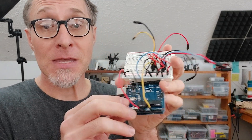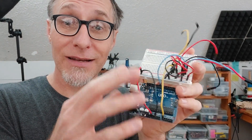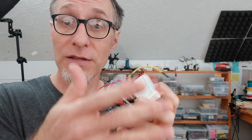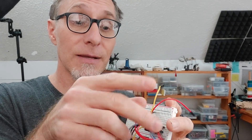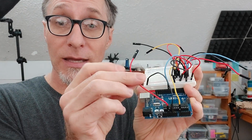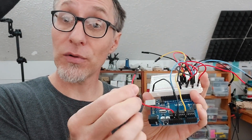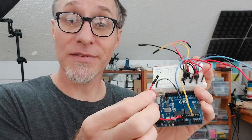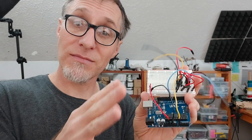Let me show you the kind of board that I see students build too often, or that appears in too many YouTube videos. Here's an Arduino Uno and a breadboard where jumpers are used to make all of the connections — you've got all this extra stuff on top. Also, the first thing that's likely to happen is you're accidentally going to unplug something, and now this is a live wire. I just happened to unplug my five volt lead there. This is the most common cause of death in electronics. So if you like to burn up money, be careful — and we're going to upgrade this.